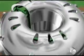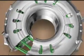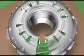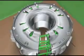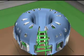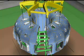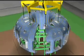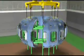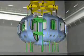After the sub-assembly of the 337.5 degree sector vacuum vessel is completed, the external Rogowski coil is installed, and then the thermal shield is installed on the vacuum vessel. Thus assembled, the vacuum vessel and thermal shield are lifted by a 150-ton overhead crane and moved to the Tokamak pit. Then the main jig is reassembled for TF magnet installation.